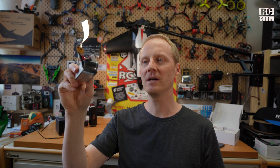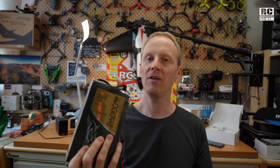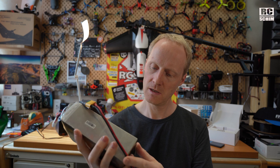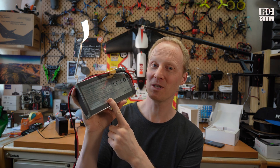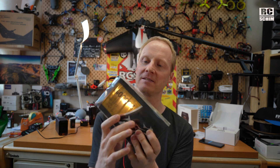You don't want the big pack fully charged all the time — keep it around 3.8-3.9V per cell for stable chemistry. If it is very empty I'd charge it after flying to 3.8V, about 50%. If it has too much power I could charge smaller packs even at home using it as a source. For the 4S packs: 4 times 3.8V is 15.2V, so I'd set the input power limiter to 15V, which is okay since they sag a bit under load. If I know it'll be a heavy day of flying I can charge the big pack fully to 4.2V. You could theoretically charge it at up to 5C — that's 130 amps and 2800 watts — but you really shouldn't. Normally charge at 1C, which is still 26 amps. I never charge it above about 15 amps, so it takes longer.